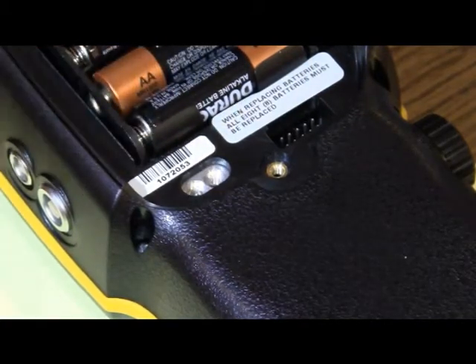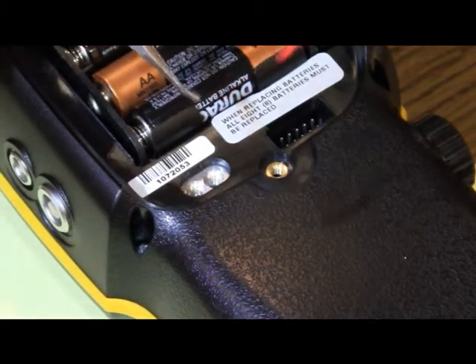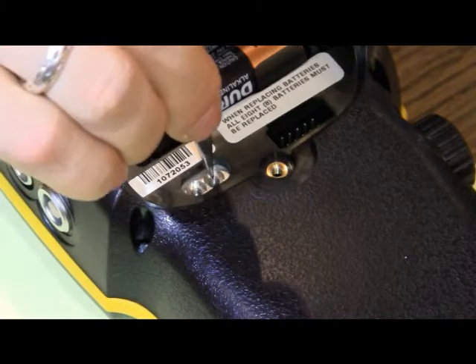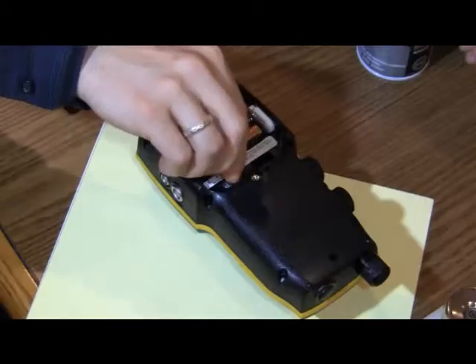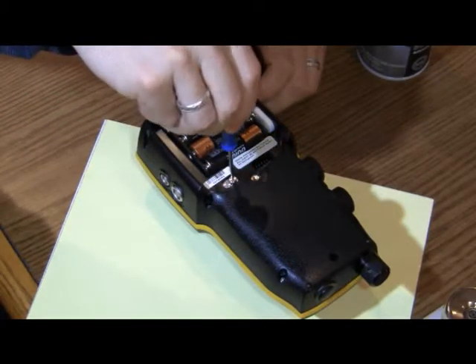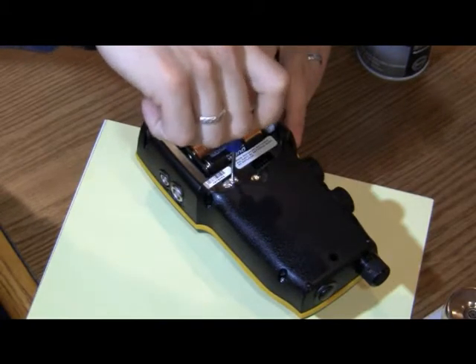Once all the parts are clean and in good order, place the o-ring and spring assembly in the valve body. Be sure the spring is properly seated on the valve body. Reinstall the valve caps and tighten gently. You will encounter some compression from the o-rings, but the caps must be tightened until they stop. Do not over-tighten.